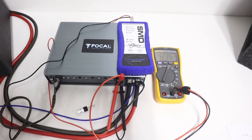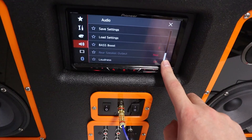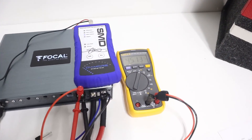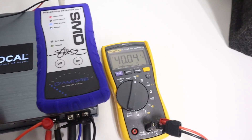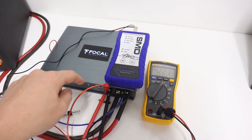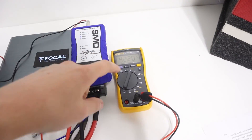What's great about this functionality is it allows the amplifiers to be really reliable. As an example, if somebody turns up the bass boost — which is known to destroy speakers — let's say they turn it up 2 dB, you can see that the amplifier is going to detect that distortion and automatically roll back the output. So it is important to educate the customer and explain that the amplifier has been professionally tuned and adjusted in order to get optimal performance, and that any unnecessary tweaks or adjustments are going to lead to a reduction in performance.